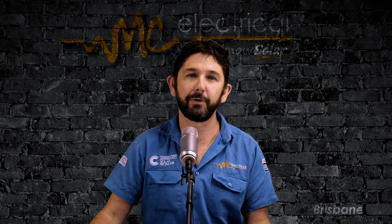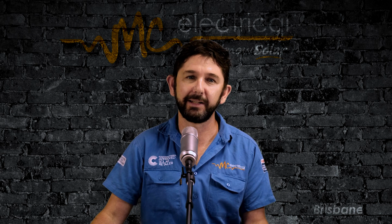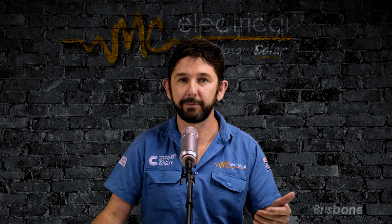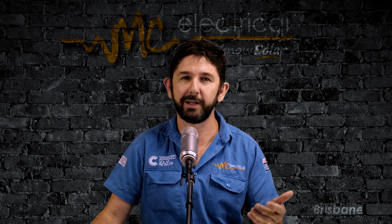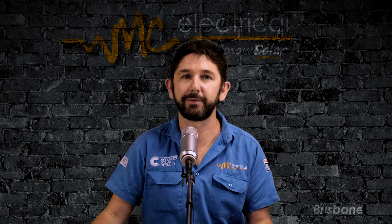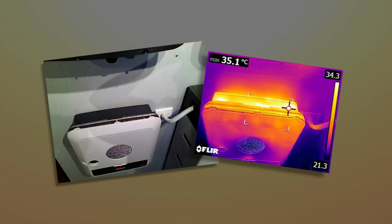I ran both inverters with the same 8 kilowatt east-west arrays that I used in the last test. I heated the room up where the inverters were to 27 degrees, which is still cool compared to summertime. The inverters flatlined their production at 5 kilowatts for around about an hour. First, with the Fronius. The outside case got to a mild 35 degrees. The internal temperature of the inverter was 46.6 degrees.